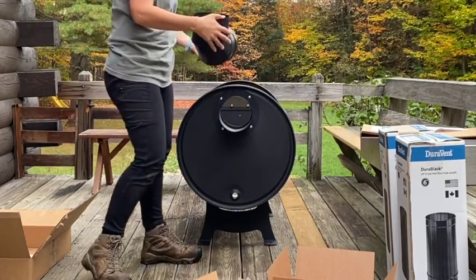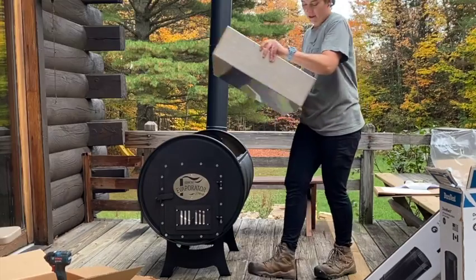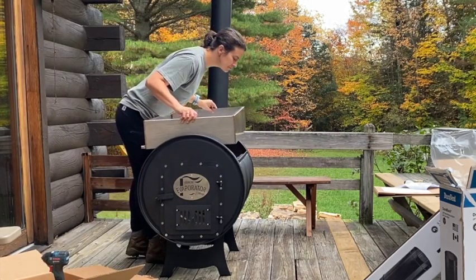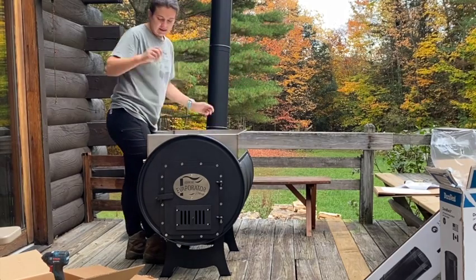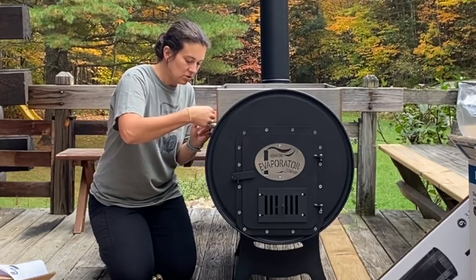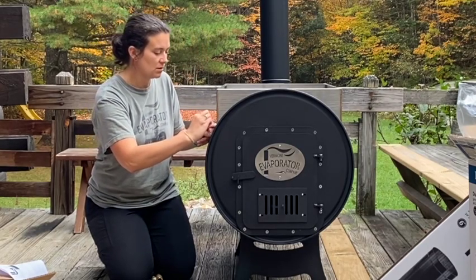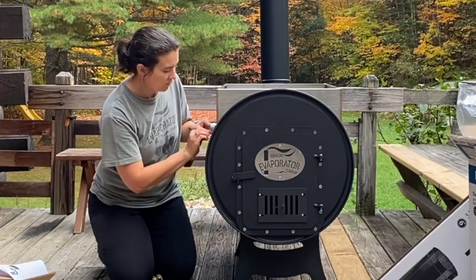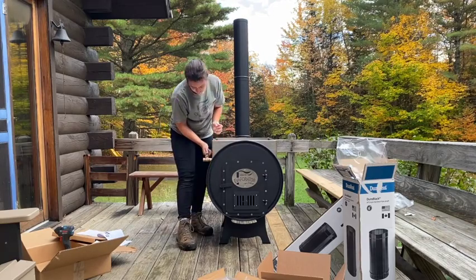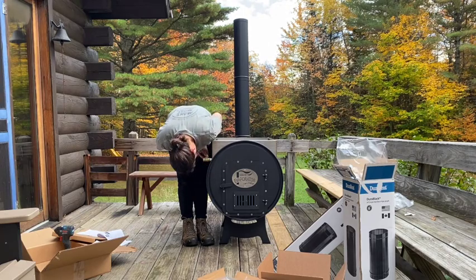Slide the Sapling stack elbow onto the flange. Place the evaporator pan and align it so that the pour spout is towards the front — it slides right into place. Take this tiny piece of pipe tape, go back just one thread so it doesn't get into our maple syrup, and wrap it around. Then attach your pour-off valve. When doing this, make sure you don't pull on the handle too much or you might break the valve.